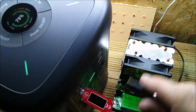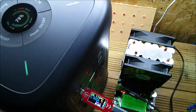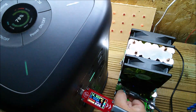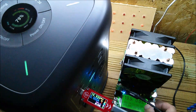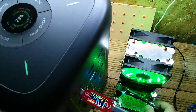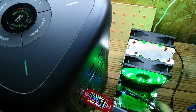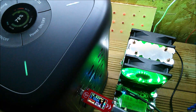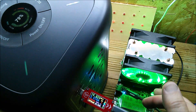Testing the 100 watt USB-C output — the NIMASO cable is only rated for 60 watts so I won't exceed that. At 20 volts I ramp the current up: 26, 42, 44 watts, and a little higher — 60 watts on the external meter, 66 watts indicated on the X700, and 57 watts on the other meter. So that's 20 volts at 3 amps — 60 watts — and the unit is certainly happy with that. I won't take the NIMASO cable any higher.